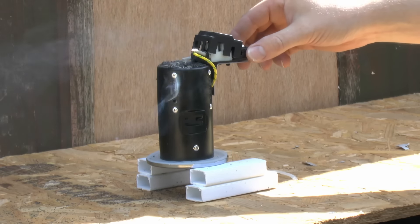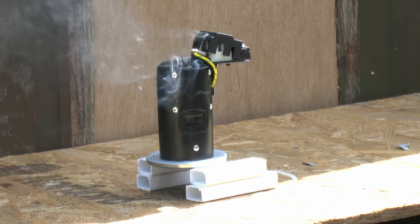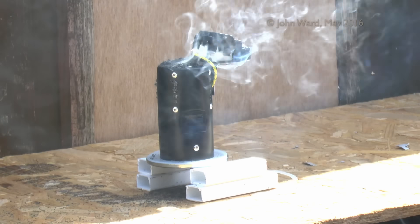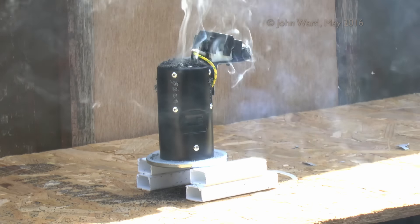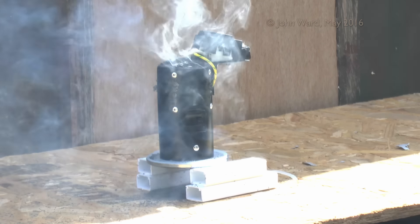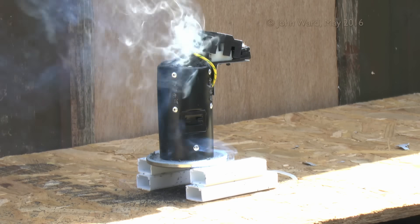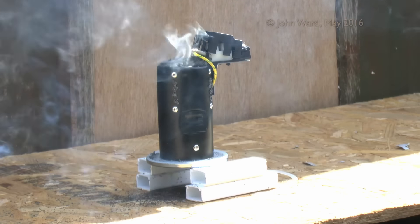Repositioning a little bit so the flame is more in the centre of the canister. On the front side there, those holes have basically started to fill up with the expanding material, and you can see a very small black particle of it just dropping onto the surface below. As with the fire hood, there is a fair bit of smoke coming out. Although the flame is not coming through, all that smoke is certainly pouring out of the top and the side as well. As the temperature increases, the amount of smoke being given off also increases considerably. On the side and the top, the holes are now pretty much sealed in, which will stop any flames coming through.